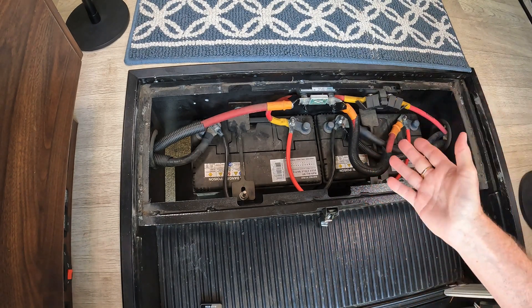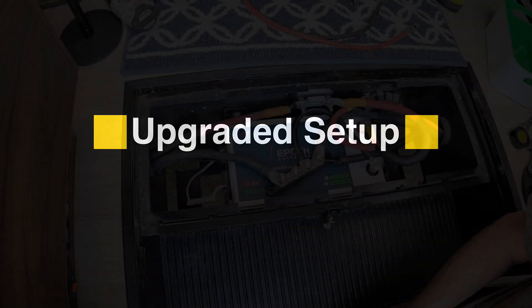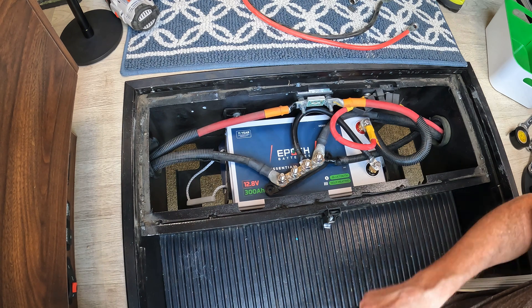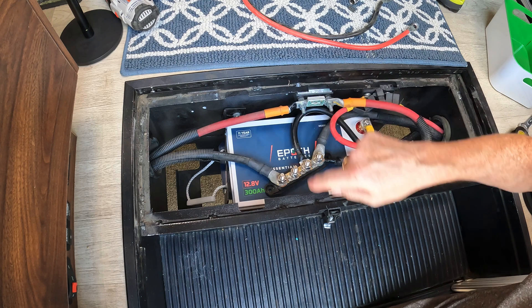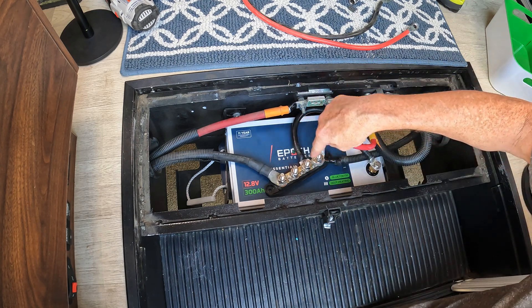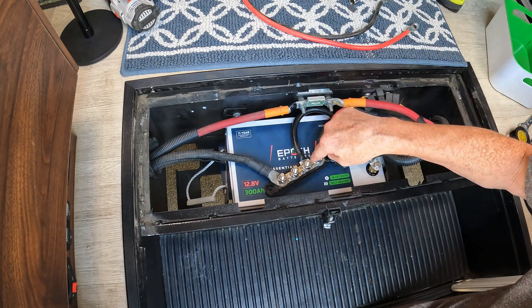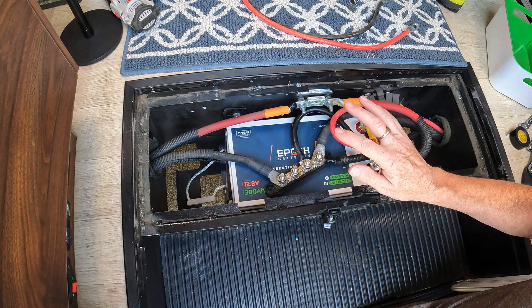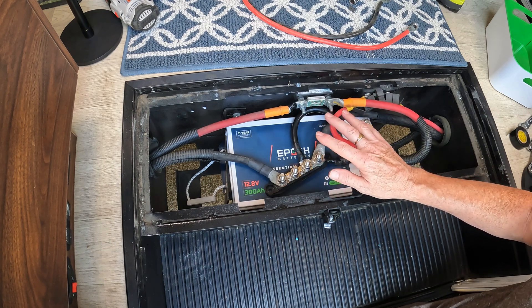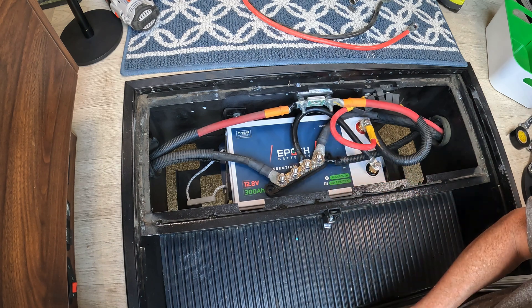We now have the new battery installed. Because it's quite a bit wider than the others, I actually had to take the fuse retainers off in order to get it in there. I have everything on the negative side wired into a bus bar because there's no way all the cables are going to reach a single terminal. I still have to do a little bit of work to secure this. But it's all in. Now the physical installation is just one part of it — we have to change some settings on the Xantrex inverter charger and on the Xamp solar charger to update them to lithium batteries so they provide the correct charging voltage.